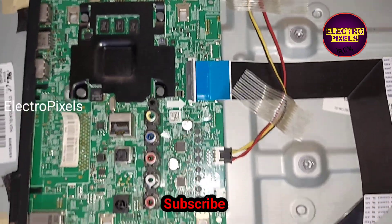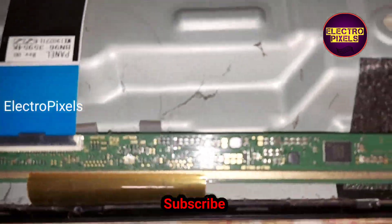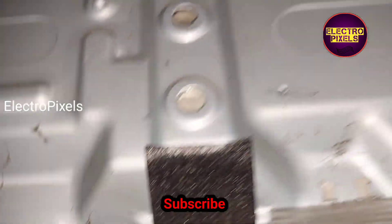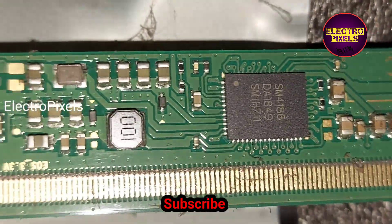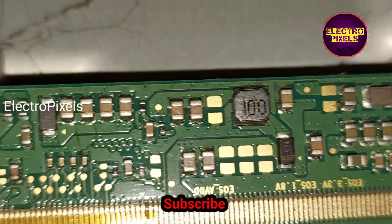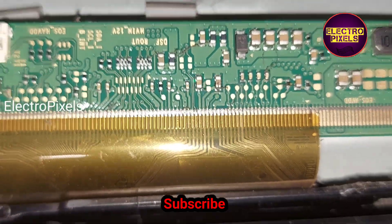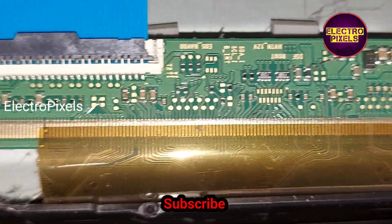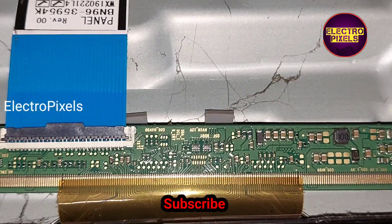This is the motherboard, and this is the panel. It's a single COF Samsung panel. The SM4186 DC2DC IC goes into protection mode because of internal shorting in the gate signals. Inside the glass panel, the shorting may be either from the left side or right side of the glass panel.